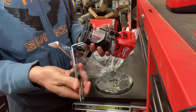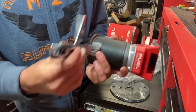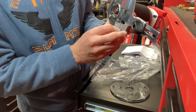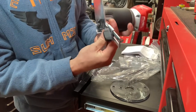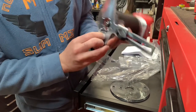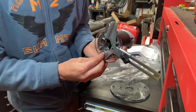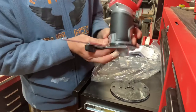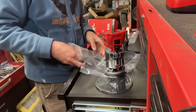This is the guide — I really didn't understand what it was for at first, but it becomes really clear. It just bolts into the side there and it's kind of like a fence for a saw, so you can freehand it and use this as a guide instead of using a router table. Essentially, instead of relying on that little bearing on the end of your bit, certain bits that's not going to be applicable. It's got adjustment on it, and I didn't think I'd ever use this but I was proven wrong later that day. That's how the slide attaches onto the side of the router base.